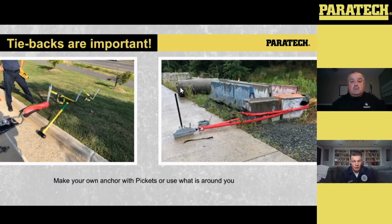And in there you see a grip puller, an awesome piece of equipment that we utilize a lot in our classes, along with some synthetic round sling to make that. The one thing I will say about the chain and the synthetic round sling, if you're using the chain or the synthetic round sling for anchors, chain not so much, you want to worry about your D/d ratio, which Josh Thompson did a really good presentation on, chain and bridles and winches and stuff, through Paratech.